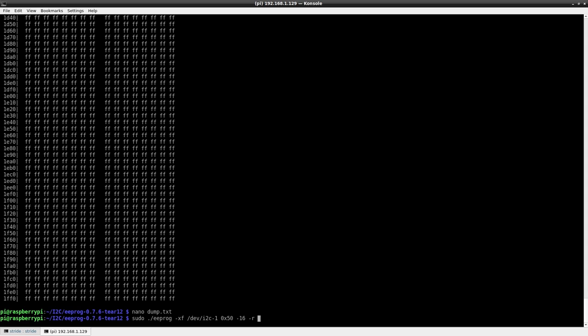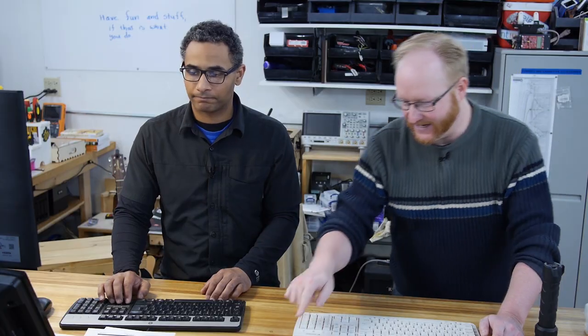Well, that's not the most important thing right now. So how about we read the save game memory first, because that's the least important. I'm sure it could restore it if it needs to. All right, yeah. So, we know we can dump 8K. So what we're gonna do is look for that. And then what I'd probably be looking for on the other chip is ASCII characters, like you have died of dysentery. We should be able to see that in the ROM dump. And then we'll know if that chip is being used for main program storage or PCM sound effects or whatever. So can I take this and restuff it? Sure.